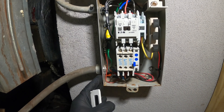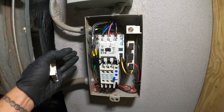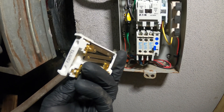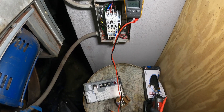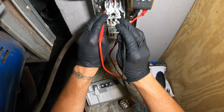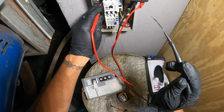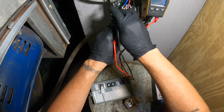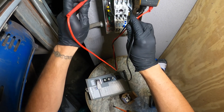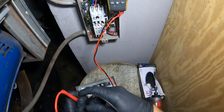The box is old, but it's all about what's on the inside — in car terms, we've got a sleeper here: old body but everything inside is nice, neat, and clean. First things first, let's put the system on volts and confirm there's no power coming in. Nothing on any leg. You can go from one leg to ground — terminal to metal. Make sure you have a good ground. We proved we have no voltage.